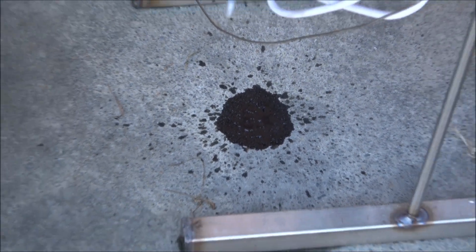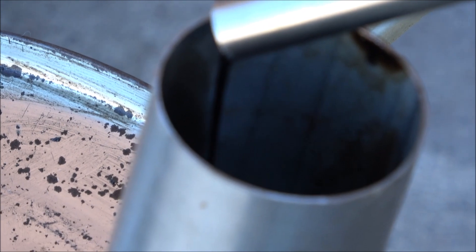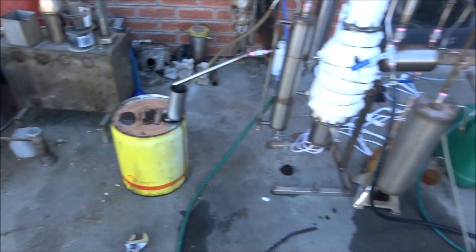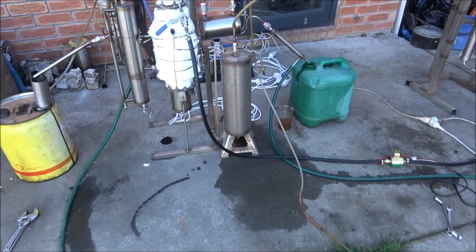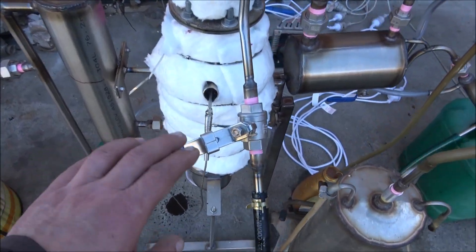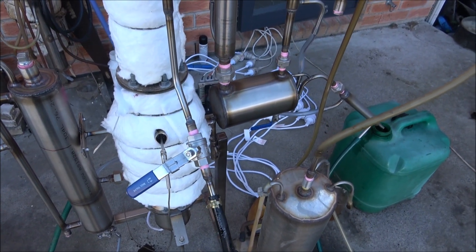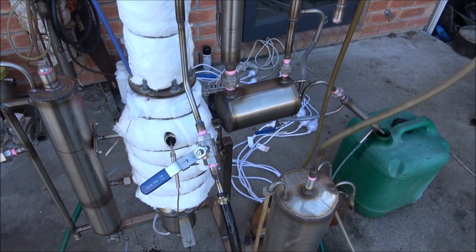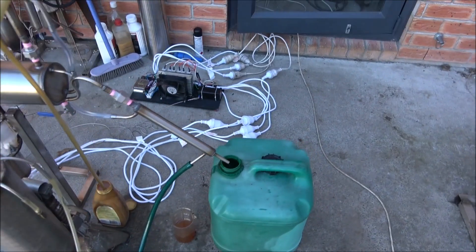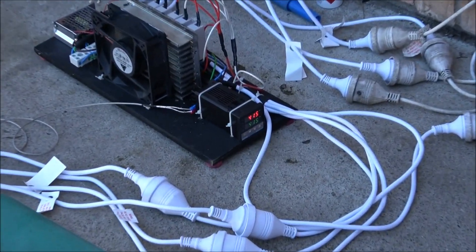I had some leakage from under the nut — I've tightened it properly now, just a few drops on the concrete. Here we've got some leftovers coming out, a bit more than I wanted, but the quality of the oil determines the amount of waste you're going to have. This particular oil is absolutely terrible — from an old diesel engine. This valve is for flow control, so you adjust the flow so that production is approximately 80% and waste is about 20%.